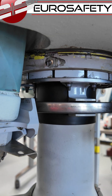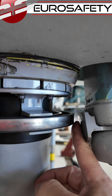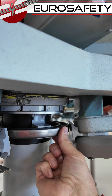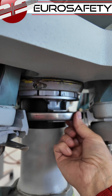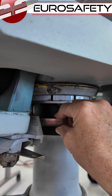If we look up here on the droop ring, you'll notice when the blades are not on the helicopter, there's actually a space here and this ring actually floats in here. So if you ever bring your cyclic back real far and you hear that duck, duck, duck sound, this is what's occurring.